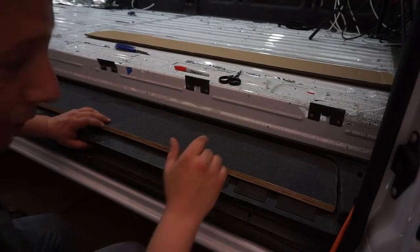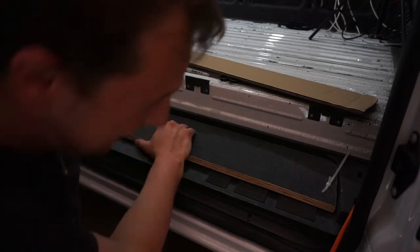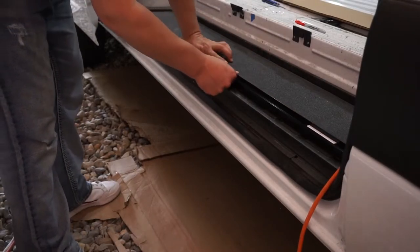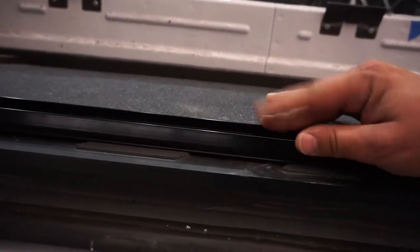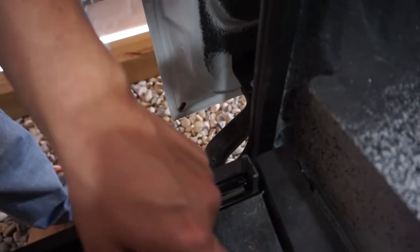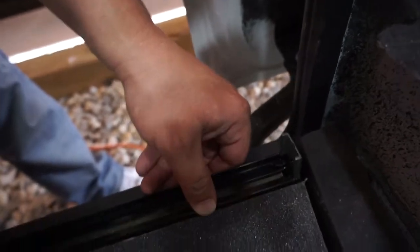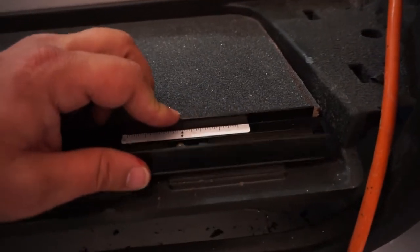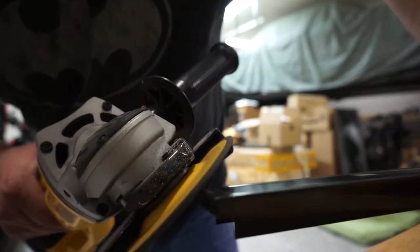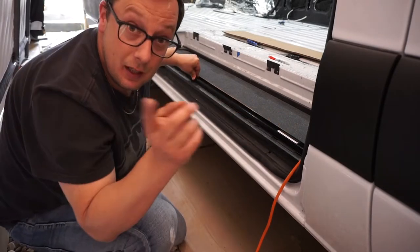Once we have the cardboard template, the wood piece fits like a stencil — it's a piece of wood and a saw, you get the point. I'm going to take the bottom rail and fit it right up against that step, and it sits perfectly flush. What I am finding, though, is that just like the step itself, the corners of that rail don't fit the taper very well — it causes it to rock on both sides. So I'm going to take my grinder to fix that, and after grinding, no more rocking — it sits down there perfectly.